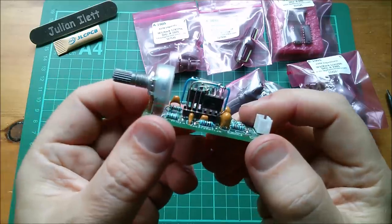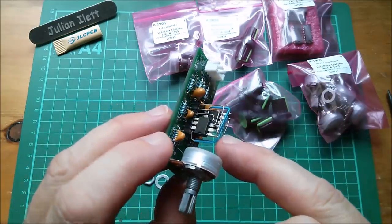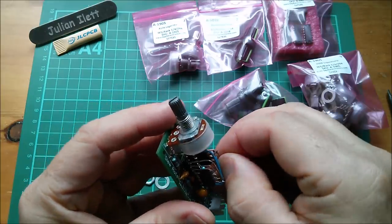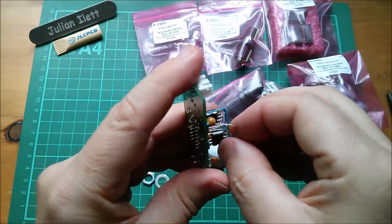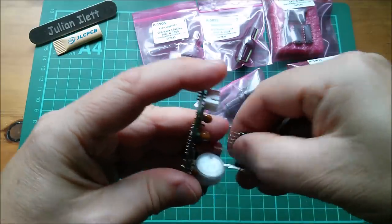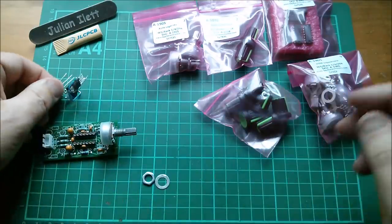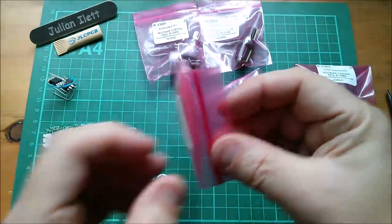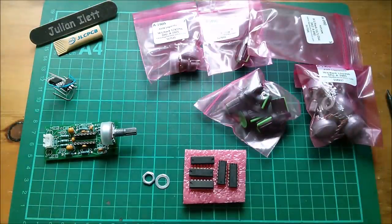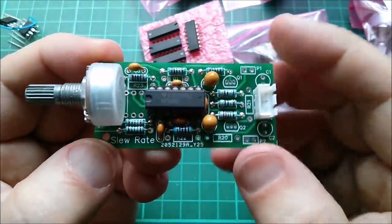Yes, this is the one. The 556 is laid out in such a way that you can use two 555s — there's a bit of cross coupling for the power connections, but they have to come out now. Well, I suppose these are going to be slung out anyway so I don't need to worry too much about keeping them neat. That was my 556 made out of two 555s and it worked fine. But now that I have the 556s I can plug one of those in and all will be well with the world. That looks better — a proper 556 in there.